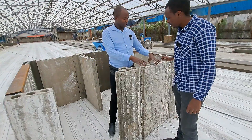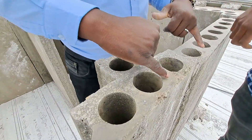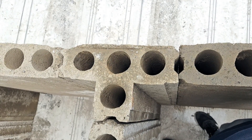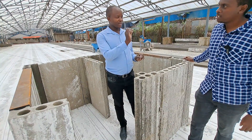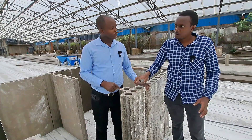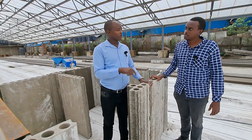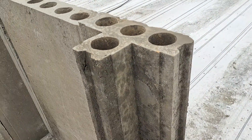The thickness of this is equivalent to the other precast panels, and it also has reinforcement — you can see it has reinforcement here, just like the other precast panels. So it's a good component which makes your work easier. This is for T-joints. You would use the precast T mostly in between precast panels for partitioning — mostly where there are partitions and in that case, there are no columns.